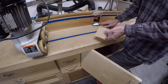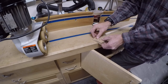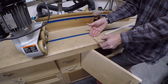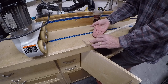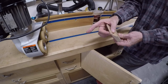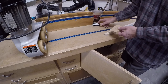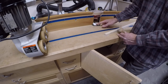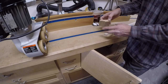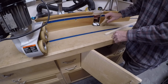But with the shaper, because the material is face up, your profile gets shaped into it from the bit like this. So it comes up on it, and this is how it produces it. Regardless of your material thickness, you end up with the exact same thickness here on everything. That's a really cool feature of the shaper. But here, it works differently. The profile is like this, so we have to actually flip the piece over. And now we have that. If there's any variation in thickness with this piece, it's going to change the tongue thickness on every piece.